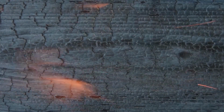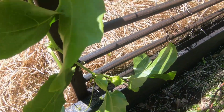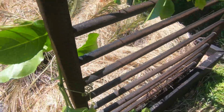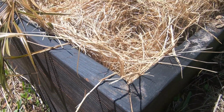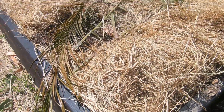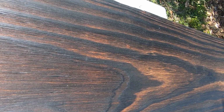Guys and gals, please be safe. Don't play with fire. We had tons of redundant safety precautions while filming this just off camera. Also, we have years of safely working with fire experience. Another thing to keep in mind is when you're using your wire brush, you should definitely wear a mask to keep your lungs ash-free. We couldn't get any masks right now because of COVID-19, but at least wrap a t-shirt around your head, something. Also, do not wear flip-flops while flame throwing. Only a fool would do that. And if you do use a propane torch, make sure to keep your hose behind you.